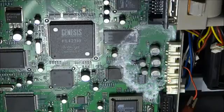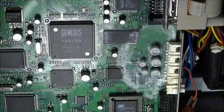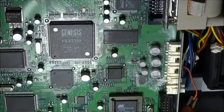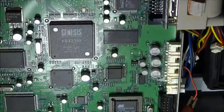Next, I'm going to induce a current. I've got a power supply here, set up for 500 milliamps output right now. So I'm actually putting current, a small voltage, into that short. And what I want to do is watch these parts and see which one of them, if any, begins to lose its freeze the fastest. Then that most likely is going to be my culprit.